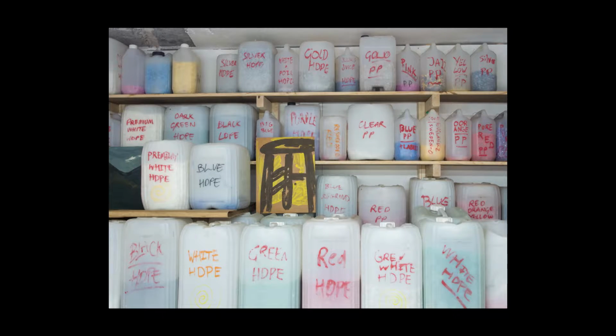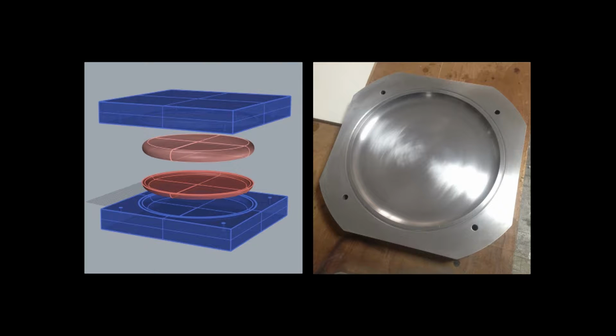So early on, we decided to use the compression method of plastic recycling, as it's easier to achieve a result that's scalable and robust. To turn our shredded plastic into an object, we designed and manufactured a multi-purpose aluminium mold that can form it into either a stool top or a tray. We designed it like this to cut down on costs and material wastage.